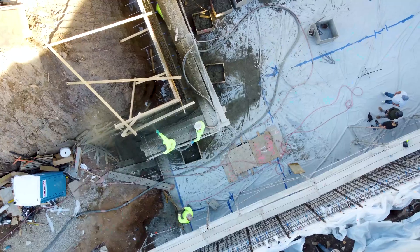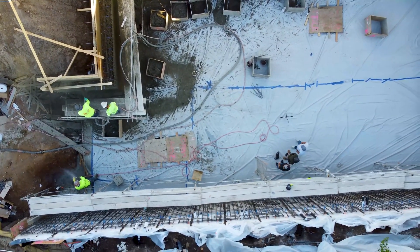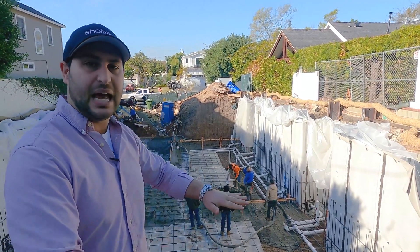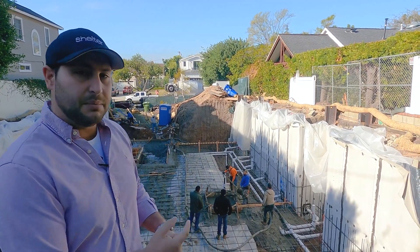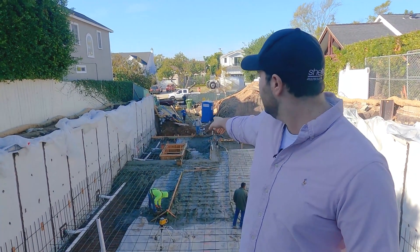Today we're going to be pouring probably all day. We're trying to get two pumps out to the site to expedite that pour. I'll show you one other thing — if you see that form right there, that's going to be set just a tad below the rest of the slab; that's going to be for the elevator pad. And then there's another form just on the other side of me — that form is for the sump pump pit where all the extra water and sewer water is going to go, and it's pumped out from there into the city.